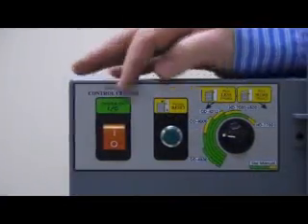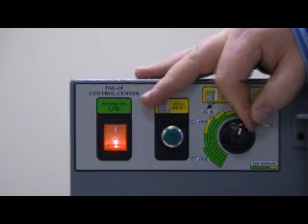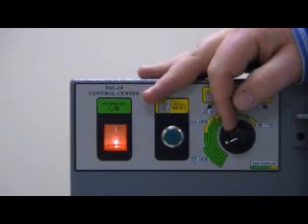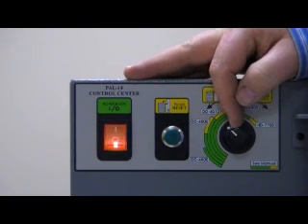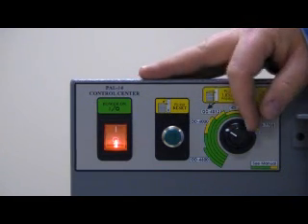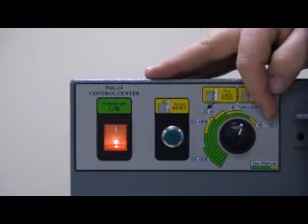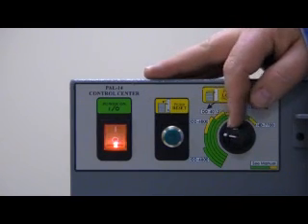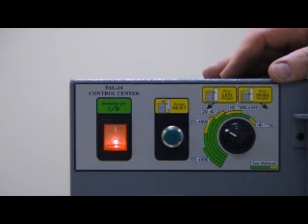This is the control panel on the Pick-A-Lift. We have power on and power off, and an adjustment knob that adjusts for different heights of paper picking. You want to keep your picker positioned in the green section of whichever machine you're using — if you're doing a 7000, keep it in the green section of the 7000; if you're doing a 7700, keep it in the green section of the 7700, and so on. You'll have different operations based on different punches since some punches can handle more sheets than others.